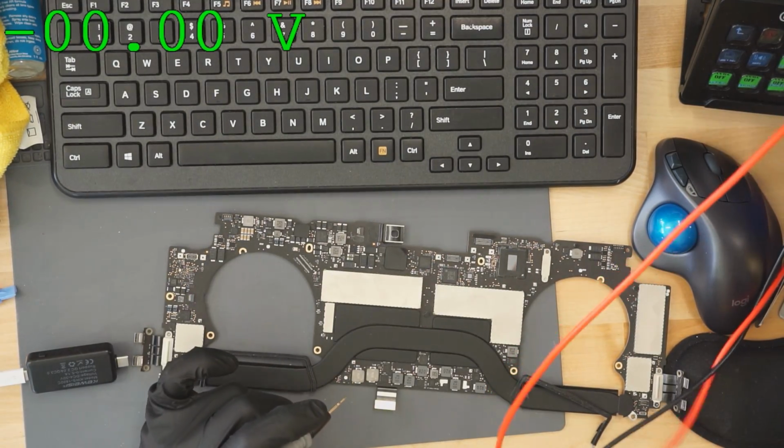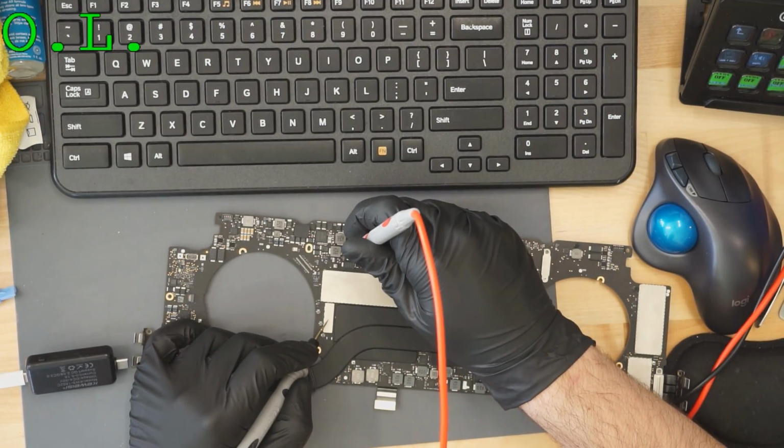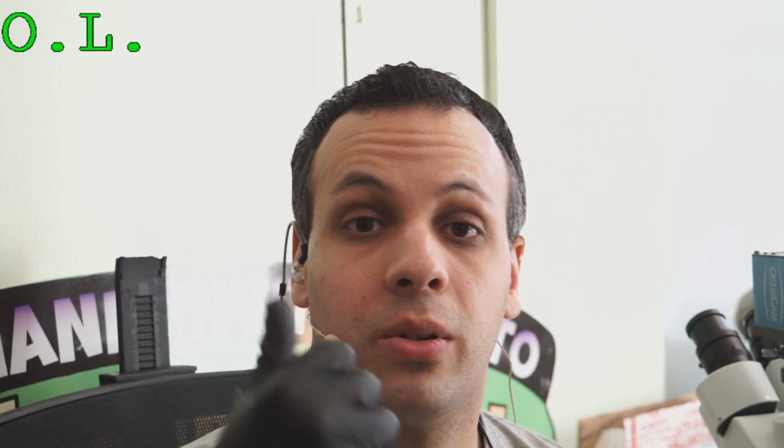Now, I'm inclined to think that this is an ISL9239 issue because the enable must have been missing before. My guess is ISL9239. Here's why. The enable was most likely missing for PP3v3_G3 hot to be created. We've done at least 3 or 4 videos on this already where PP3v3_G3 hot is missing. We're only getting 5 volts at the charger because PP3v3_G3 hot is missing and the CD3215s are not getting their power. And ISL9239 is not creating the enable for it.